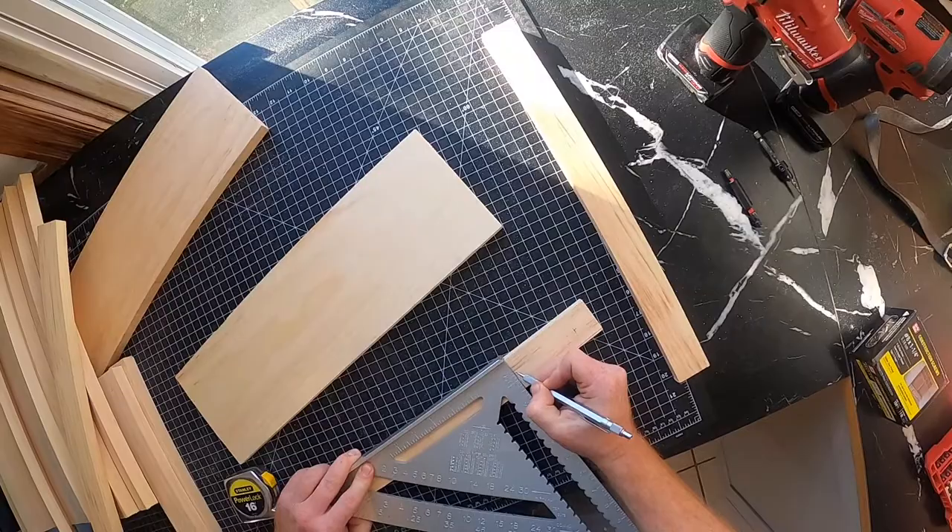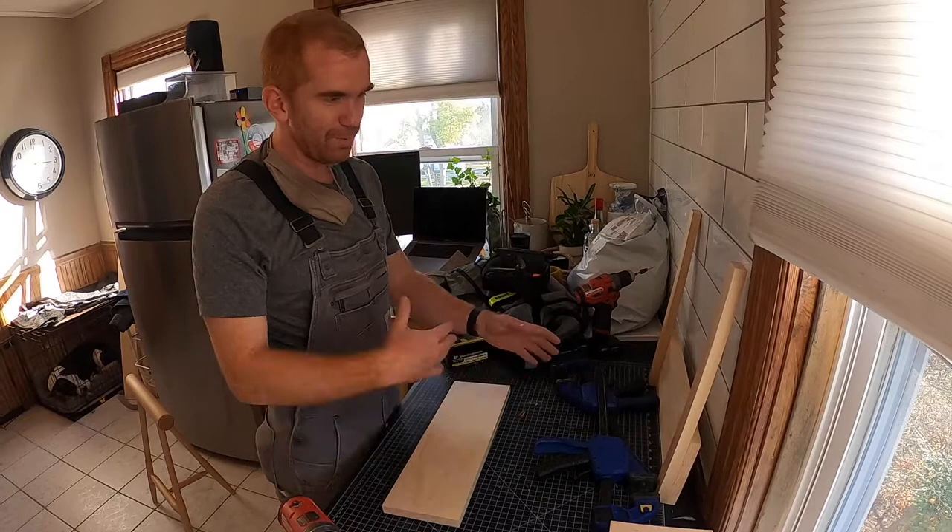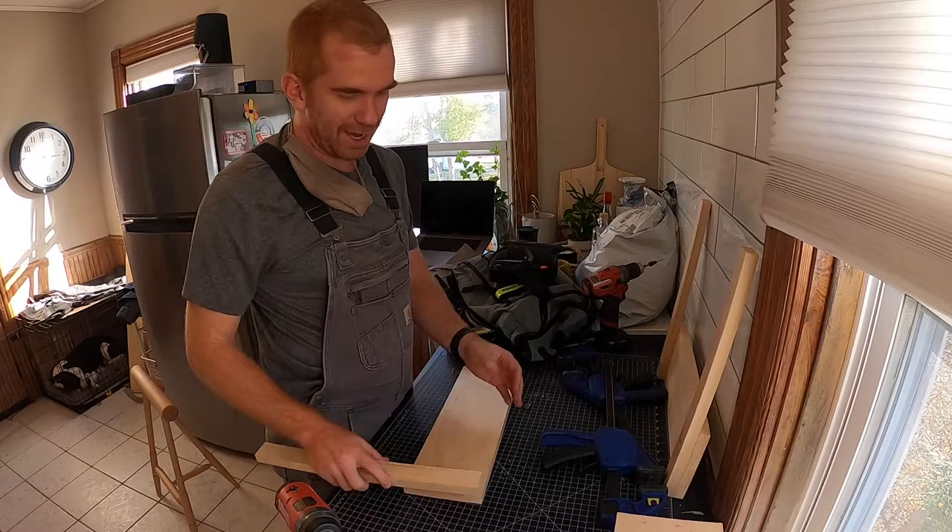We're going to come over to the other one and do the same thing — put a plus sign at the three-quarter mark. Now we have the locations for the two screw holes. One of the tricks of making things is making sub-assemblies. Rather than putting the whole chair together at once, we're going to put together sub-groups, and the first thing is putting together the sides that have the legs attached.